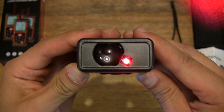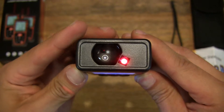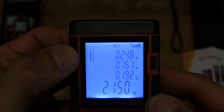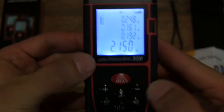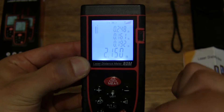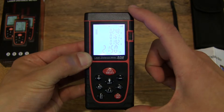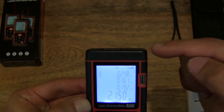Just to show you the front — never stare into it — but you can see the red laser pointer or red dot, and the measurement lens. There's also something to note: on the top left-hand side of the screen is a reference position indicator. By pressing this button, it will give you readings based on your reference point, whether it's at the front or the back of the laser distance measure. If measuring from the back, it will include the entire length of the device. Let's set it to the front so that it measures from the front onwards.